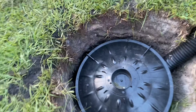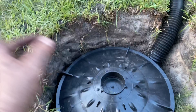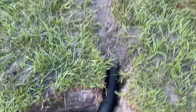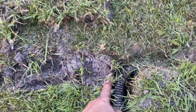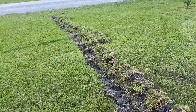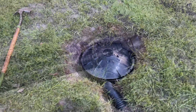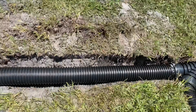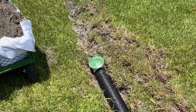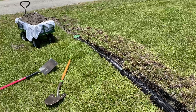So we have it buried. There's a surface inlet that can go here — I decided not to put it in because I figured this is probably going to get full pretty quickly and I don't want it overflowing into the yard. I'm also going to get a coupler here and put another pipe going down to the street for overflow. I've attached a coupler here — this one goes out to the well, which is right here. I've covered it all back up with sod and dirt, and this one goes out close to the street and has the overflow pop-up. So now all I have to do is bury everything, put sod back on top.